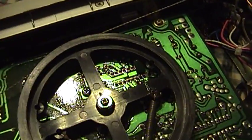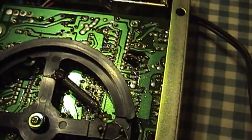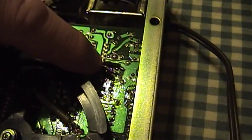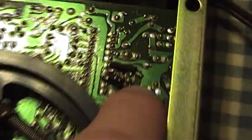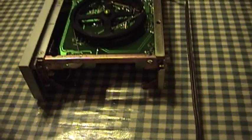Now there are some interesting things on this board. There's a little capacitor sitting there on two pins of the LA-1245. And there's also something over here that looks hand done — I don't know if this would have been rework done further down the line. There's a jumper wire going to the QAM decoder, a little tiny resistor, and another jumper wire there. And there's a tiny little trace cut right there that you can just see at the tip of my fingernail. So I'm not sure if that was factory rework or what.